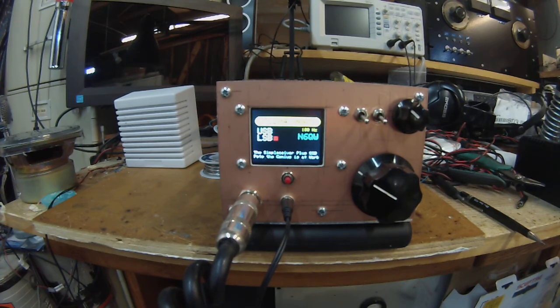Yes, that's what it has — it has an Arduino Nano that drives a color TFT display. The frequency generation is with a PLL clock generator, the SI5351. It simultaneously generates the VFO for tuning and also generates the upper and lower sideband BFO frequencies. The SI5351 PLL clock generator is a board you buy from Adafruit Industries for eight bucks. The Arduino Nano you can get for about five or six bucks. A color TFT display is about five bucks. So for a $20 bill, Charlie, you can have a microcontroller controlling the SI5351 with a nice color TFT display.